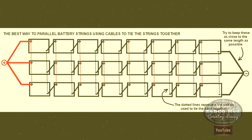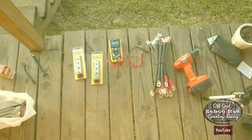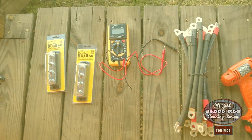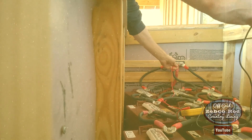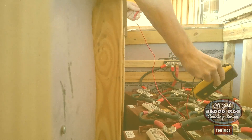For the last few weeks we've been trying out this reconfiguration of our 24 volt battery bank. This diagram shows here that we found at solarhomestead.com. We also installed a positive and negative bus bar. Since we installed it, there are two things I noticed — nothing major. The first thing: you could check your voltage at the battery bank and it would say 25.4, then you'd go inside and look at the Outback Mate and it would say 25.2.